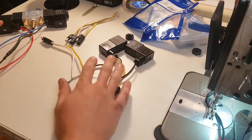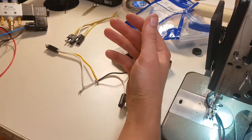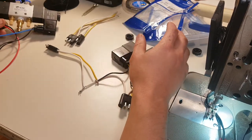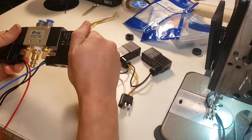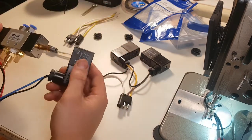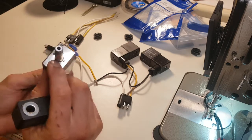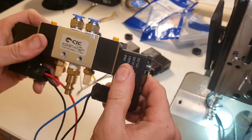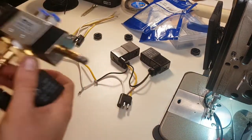This video is going to be on the wiring of the solenoid pack. We have the benefit of doing two machines at once and making these videos post-partial installation. This is one of the solenoid packs — it's got these plastic nuts that hold on the actual coil around this shaft. There are detents with corresponding locators so you can position it at different geometries to suit your needs.